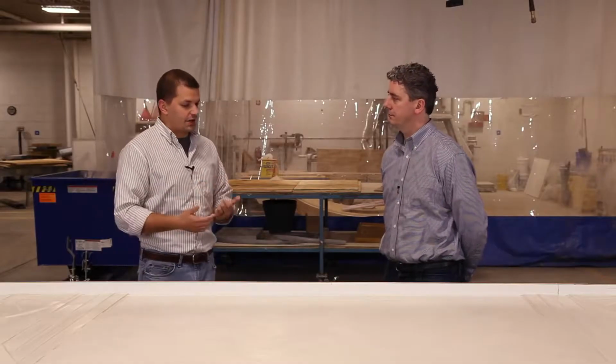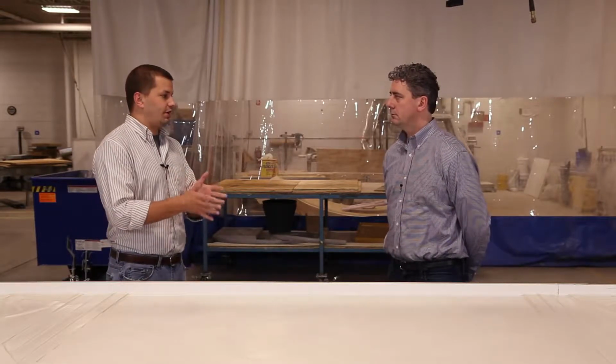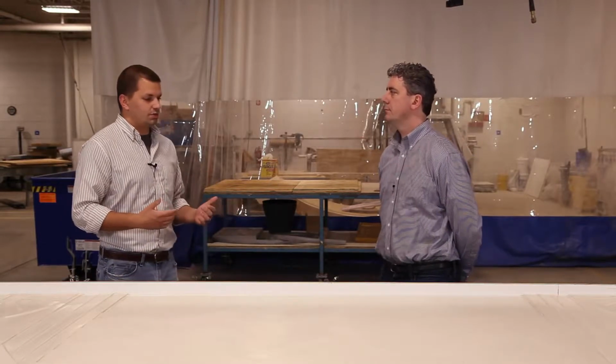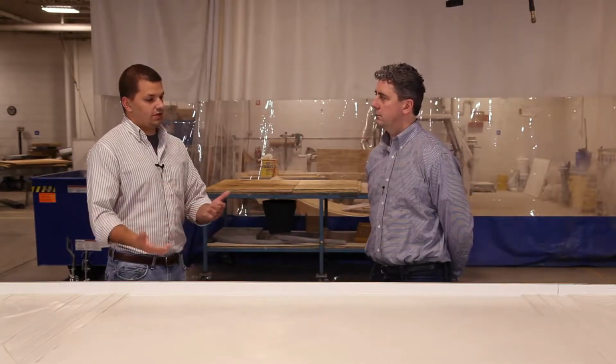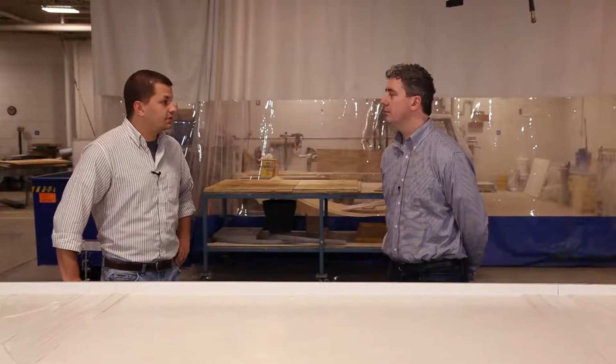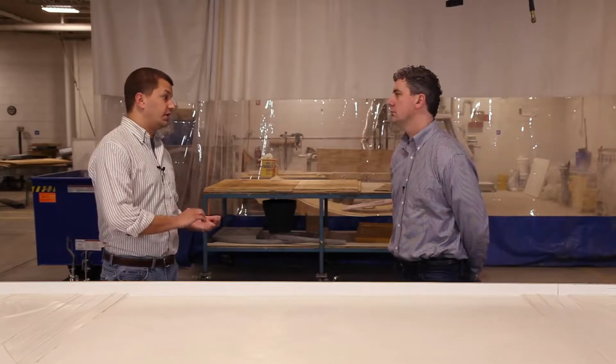A lot of those permanent formwork applications are strictly utilitarian in nature. There's no design aspect. So for this Art Deco project, we wanted to add a little bit of design to it, hence we're using the GFRC panels. So the rubber form liners are typically used for decorative applications? Yeah, certainly. We have a lot of clients that use rubber form liners for those wood and steel molds. But for this project, we found it more efficient, quicker, and we could control it better by making all the cast panels here in our shop from one form liner instead of having multiple ones.